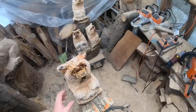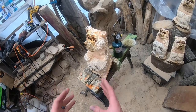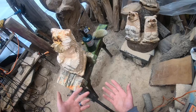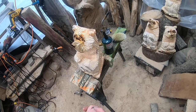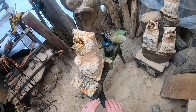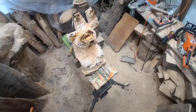So first things first, here's this bear. You want to have a fire extinguisher, a bucket of water, something like that on hand. You also want to have your gas cans away from where you're going to burn. I'm just keeping this under the tent. For the sake of the video, you'll see me do this a lot, but this is dry sawdust. It's very flammable, okay? So if you can, take these out to the driveway and put them on a cinder block so you don't torch your driveway or anything, so they're up off the ground. Burn your bears there. Sometimes I'll take them out in the grass if I have a lot to do, and I will put down a couple cinder blocks, stack them up, and put the small bears on top and burn them. One, you don't have to bend down. Two, you're not burning the lawn or anything else up. So just keep all that in mind, okay?